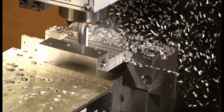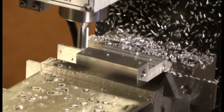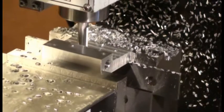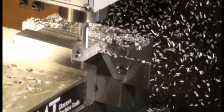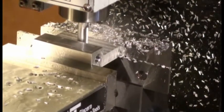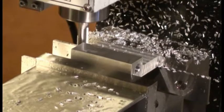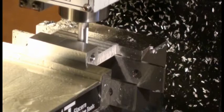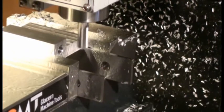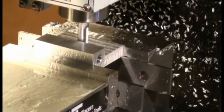This is pretty well getting towards the end of it. At this point we're taking pretty small cuts — about 31 thousandths of an inch — and then one last pass to finish the final dimension of the part for the back half.